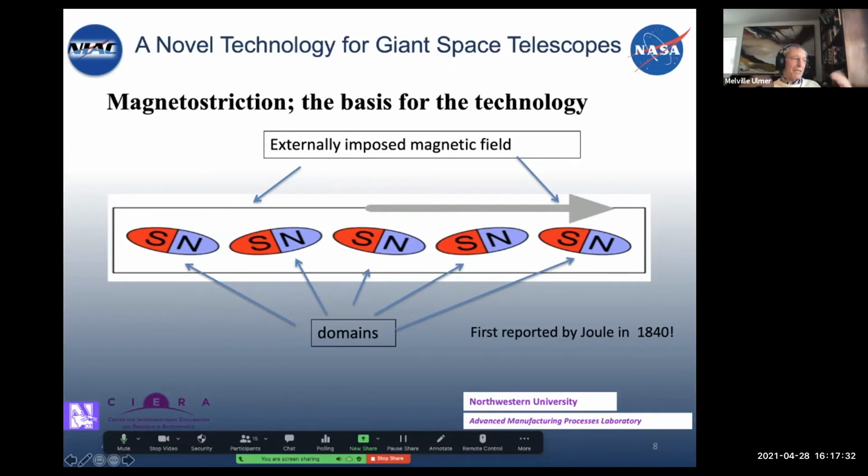for sonar in the 60s called Terfenol-D. And that material has a giant or super response to a magnetic field. So you coat the back of your substrate with this, you apply a magnetic field, and you will generate a strain, which then generates a stress and changes the shape of your mirror. And we hope for the better, not the worse, right? So we'll come into one other little detail related to that in a minute, but this is enough for now.